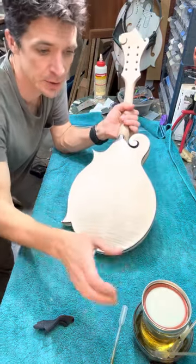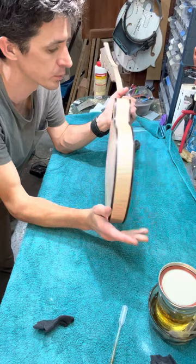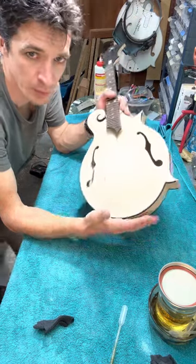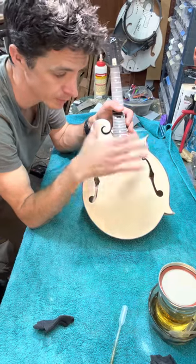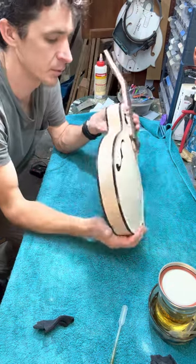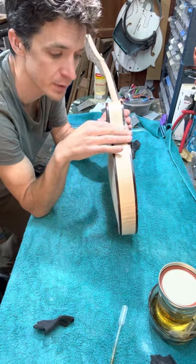I've applied a wash coat of shellac to Michael Fath's mandolin. This is the blonde one I'm making him — I'm also making him a black cherry one. When I apply the wash coat, it's not necessarily the final thing before I start the French polishing. I'll actually do a couple of wash coats, and then I'll look at it again because sometimes the wash coat helps make the grain kind of pop, or you can see things that need a little more sanding.